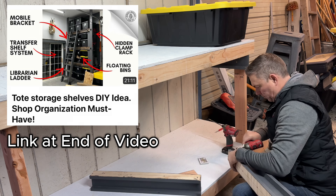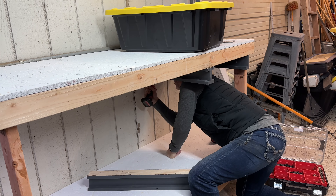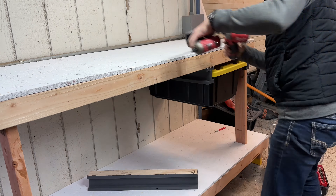I'll put it in place and then attach them in. When I actually pull out the tote, the cards will fall out and we'll collect them. That way, I've got roughly about an eighth of an inch on both sides so the totes can have a little bit of spare space in there. We're going to do the exact same thing on the mirror opposite side — notice we have the L-beam on the outermost side and the I-beam more towards the center. Again using those four cards as spacers. This way we can guarantee a fit for the 17-gallon totes on the upper shelf versus the 27-gallon totes on the bottom. Now, here's one of the things we talked about earlier — pivoting. That center space I was about to get to was actually too large for the totes to fit, so I took an extra I-beam and put it in there to make it fit to size.